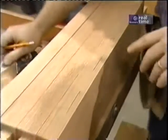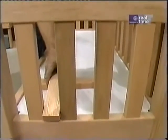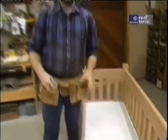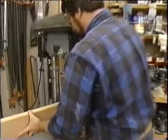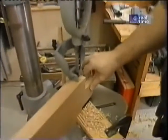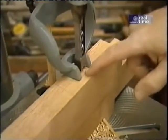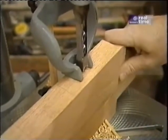I've just laid out for some mortises I'm going to cut to hold the slats in place. The slats are set up so that the space between them is equal to the width of the slat itself — that's purely for aesthetic reasons. There's a whole series of slats on the side and down the back. I'm going to use the drill press again, still set up with the mortising attachment, to cut mortises about an inch deep, centered on the piece, a half inch wide, and about two inches long. There are quite a few so it's going to take a while.